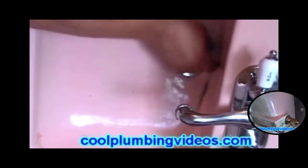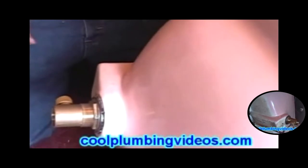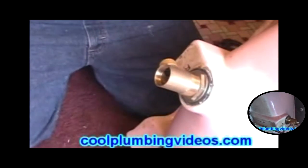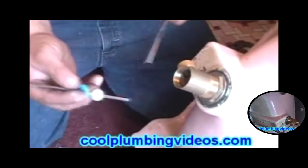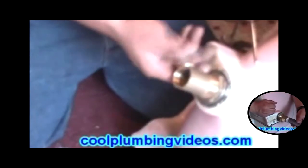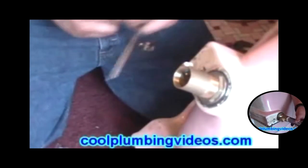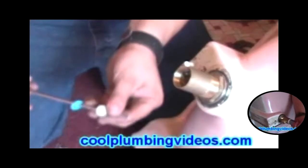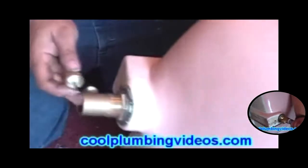And now here's the excess putty that's oozed out from the other side. And here's our trip lever pop-up assembly for the trip lever. This is usually the best time to put that trip lever in before you put the tailpiece in, because you can see right exactly what's going on just looking through the hole.